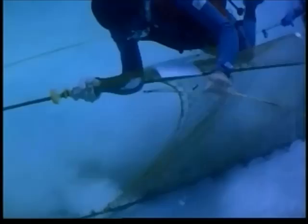Each net was rigged identically and carefully tuned to operate properly. Adjusted correctly, the center of the net foot rope operates 4 to 6 inches above the bottom. At the wing sections, the foot rope may be slightly higher above the bottom unless additional weight is added. Scuba divers assisting with the filming will measure the spread and height of each trawl.